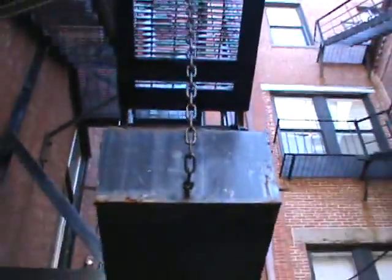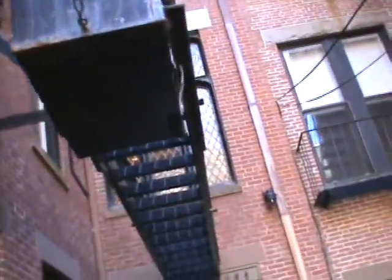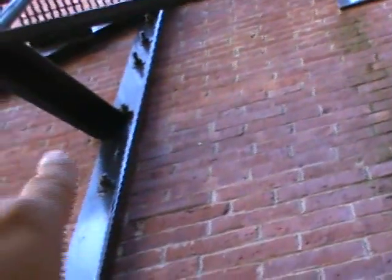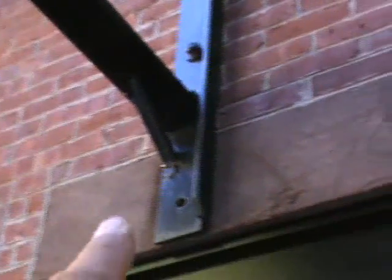Another indication that this thing wasn't properly balanced is this chain, which is an indication that the fire escape wasn't built to come down all the time, and that release arm is not acting properly. Now, looking underneath here, another issue: half-inch expansion bolts, where there should be, as the law requires, three-quarter epoxy bolts. I need one on that side, I need one on this side, epoxy bolts, and those can stay, but I need epoxy bolts on this side and on that side. I need to confirm that these are epoxy bolts, otherwise I need epoxy bolts primarily up by that bracket. I need some of these welded connections rebolted so that we don't have to x-ray or load test those connections. As you come down the cantilever, you start seeing rusty tears coming down a lot of these.